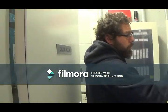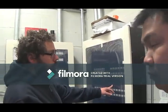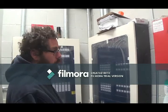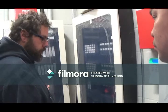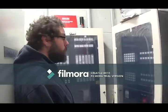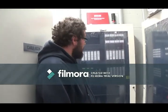That is your monitoring for the panel. Anytime you get a trouble or an alarm, a signal will be sent to your monitoring company and they'll call you. If it's a trouble, they'll call you. If it's an alarm, they're going to dispatch the fire department right away. You'll see any troubles come up here. It's an addressable system, so it'll actually tell you exactly where it is.